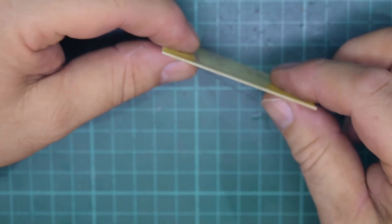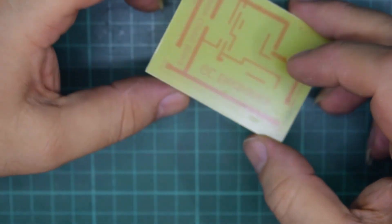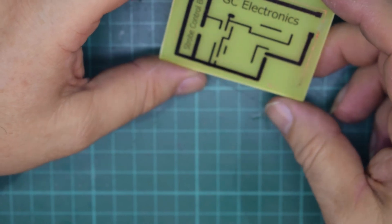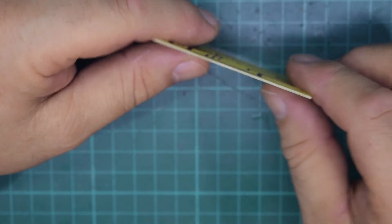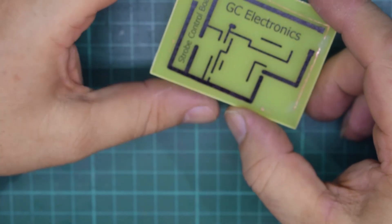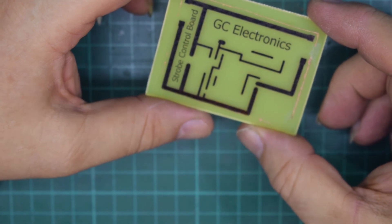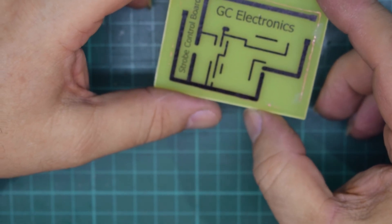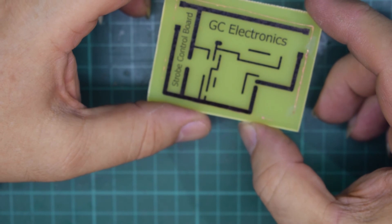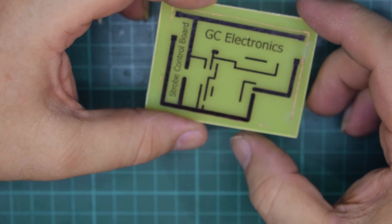Also make sure that the actual piece of paper is bigger than the piece of copper board you're going to put it on, so you don't get that copper edge. This is a very thin piece of PCB — one of the thinnest pieces you can get — which is why I was just messing around with this rather than using a top-grade piece of FR4, two and a half to three millimetres thick. I think it's come out okay — all I've got to do now is drill it and populate it. Maybe I'll do that as another video, but for now, thank you very much for watching — hopefully we've both learned something. Thanks, bye.